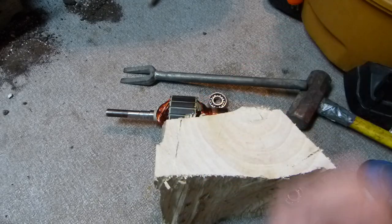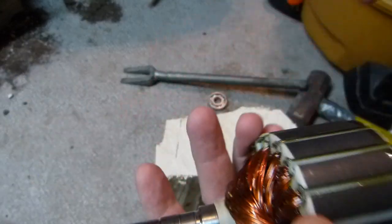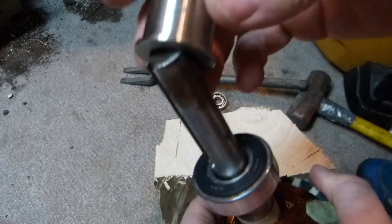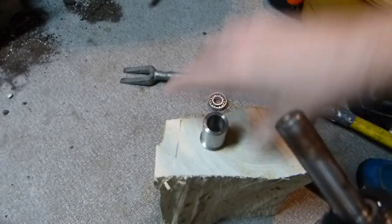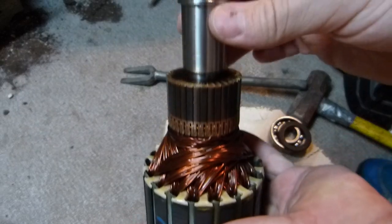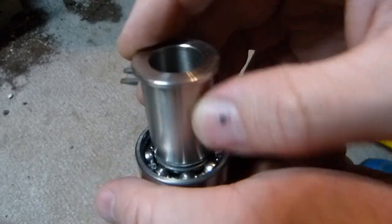Installation — these are still mint in package — will be straightforward. We'll need a little bit of lubricant, some grease, so from the second shoulder to the third shoulder this needs to be lubricated, just a little bit. For installation, because this is an inner ring interference fit and the new bearings will have their rubber seals in place, you need a tool — a piece of pipe or sleeve — that fits over the motor shaft without getting stuck at the first or second shoulder, clearing all the way to the third, on both ends of the shaft. It also needs to be only as big as the inner ring, so that the inner ring is forced forward when you tap on the sleeve.